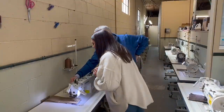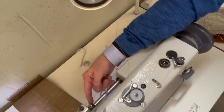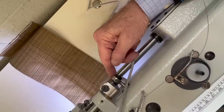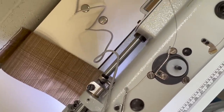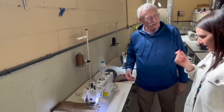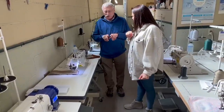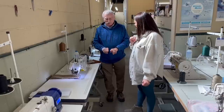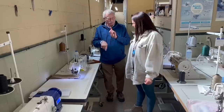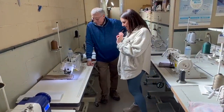All you need is the wrench from the drawer — you loosen this nut, slide the whole bracket up or down like a protractor, and tighten it back. That changes the walk to high or low. If you've got soft leather and it's pounding, bring it down; if you need it to climb — like when you're doing handles — bring it up. It keeps the stitch length the same but stops the pounding. Most people find a sweet spot and don't even know this adjustment exists.